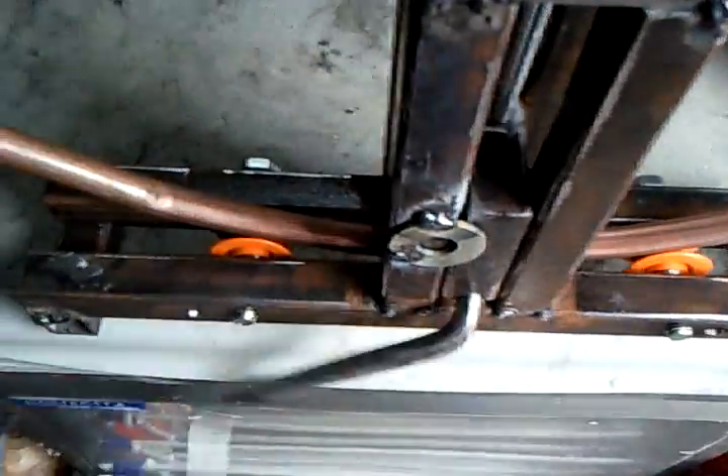The main pulley is an interference fit. Sam helped me out with that because these plastic pulleys have a funny bore diameter, so I used some 15mm tube machined down a little bit to fit inside. There are 12mm bolts for the outside ones, and Sam's made this rod for the crank handle — it's an interference fit inside, plus I've Araldited it as well just to make sure.